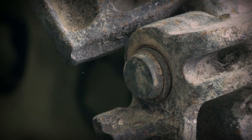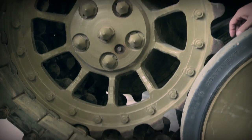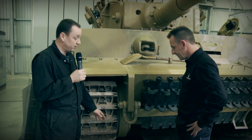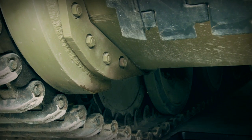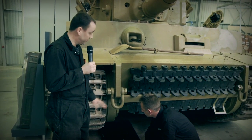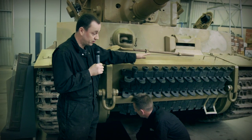Slack in the track — if there's too much slack it's going to be too sloppy and make the drive not very good on the tank, so we always check adjustment. On each side obviously is what's known as the final drive. Within the final drive is oil, so the other thing we have to do is check the oil levels. If the oil is too low it can cause a catastrophic failure within the final drive, which we don't want. So they're checked as well — one this side and obviously one on the driver's side.